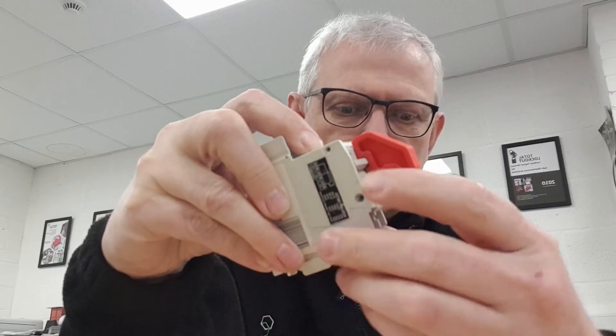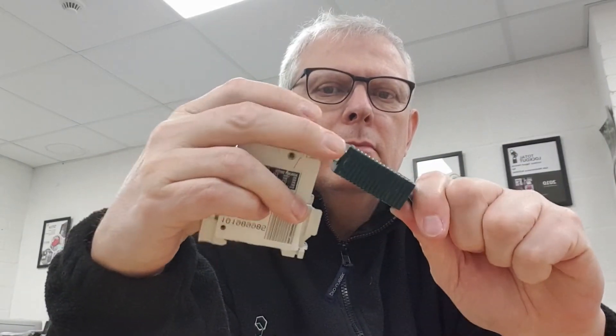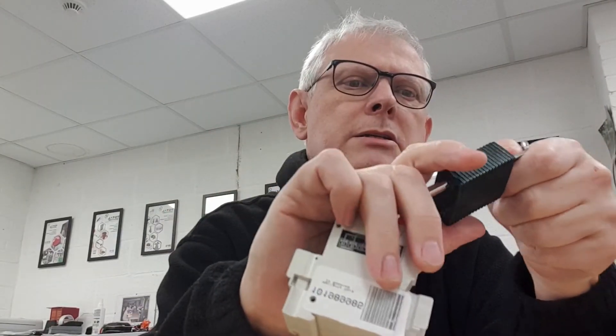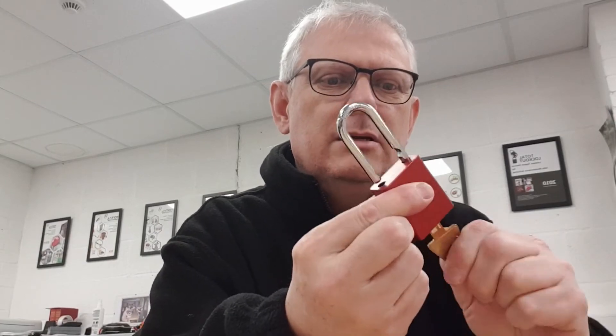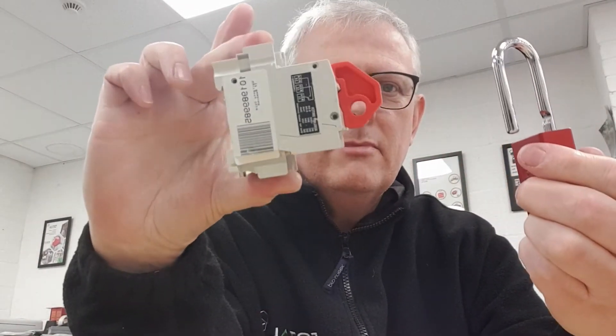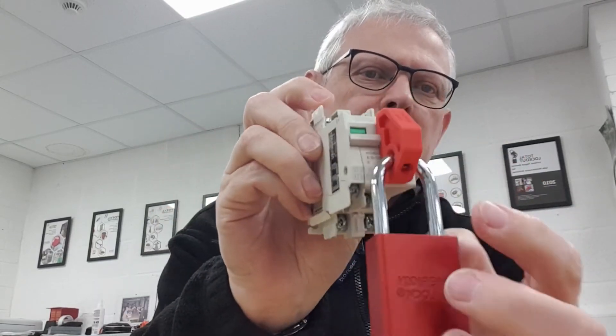The last task is to add your lockout padlock. Padlock goes on, key comes out — that's a Brady padlock, but we'll try an American Lock padlock instead, as the key was jamming in the other one. Shackle open, into the locking device, and snap the padlock shut.